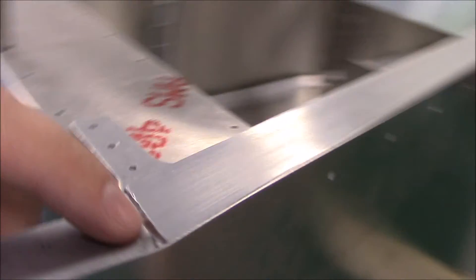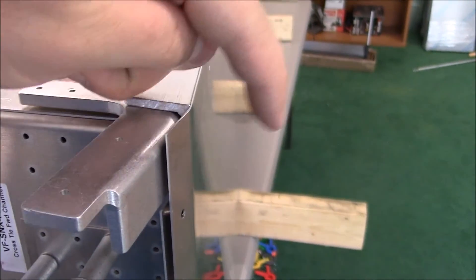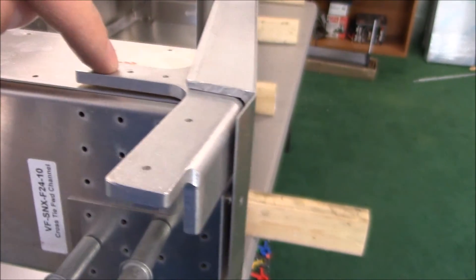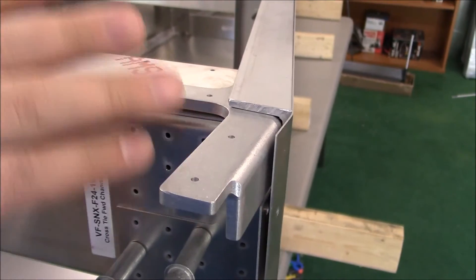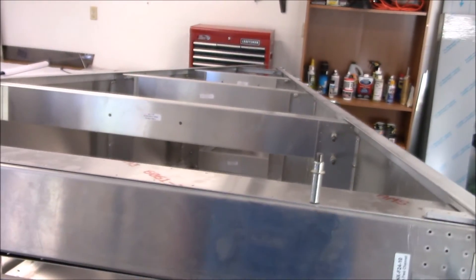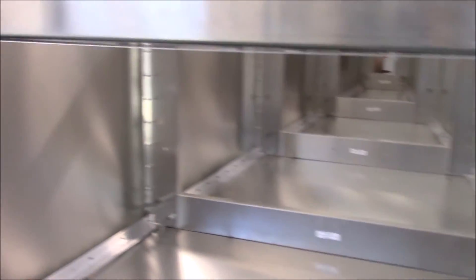I'm going to drill these properly, which requires 3/16 inch holes and heavy duty bolts. They go across and attach to the longeron, through the skin, through the longeron, through the gusset, and then this particular piece also attaches to this upper cross bar, as well as — I believe, I'll find out later — to these upper turtledeck pieces that attach for strength through the whole structure. But it's looking pretty good, so I'm going to keep cleaning up the shop so it'll look nice for tomorrow.